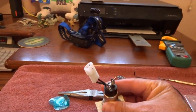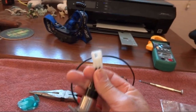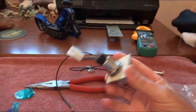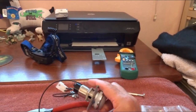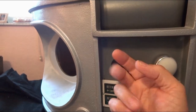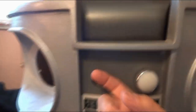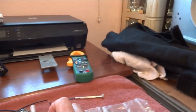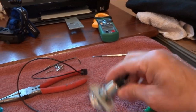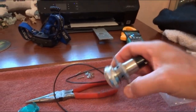Like I said, I just drilled a little hole in the back, ran the socket through the hole so it sits inside the body, and I put a little Molex connector on the back so I can plug it in and out easily. That piece you see is my version of a washer — the guy who built this before me made the opening really big so the socket just drops through without the cap on it. The nut wouldn't lock down, so I took a piece of plastic from a pinball machine ramp, cut it out square, drilled the right size hole in it, and that just screws down and gives me a nice tight fit once I put the cap on.